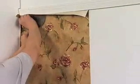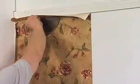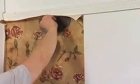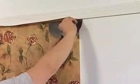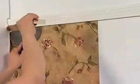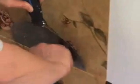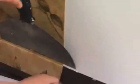Using a snap knife or razor blade, cut against the taping knife, using the edge as a trim guide. Remove excess paper. Do the same for the inside corner and the baseboard or floor. Use a new blade to avoid tearing or shredding the paper.